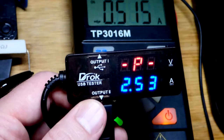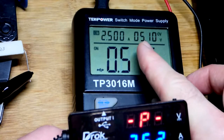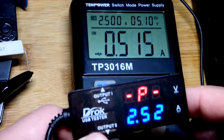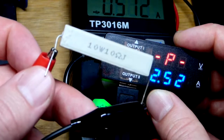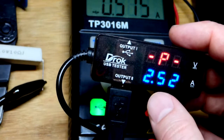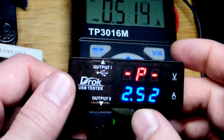We can click it again and now we've got power. That's pretty simple — 5 volts times 0.5 amps, that's the power in watts, so we've got 2.5 watts. Remember, we are powering a 10 ohm resistor, so it's getting really hot — that's a lot of wattage. It's a big resistor though, it can dissipate the heat, but you don't want to touch it. Good chance you'll get burned.